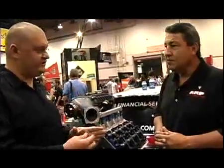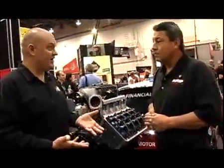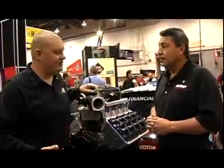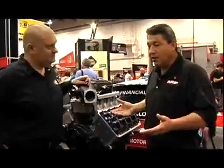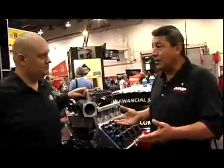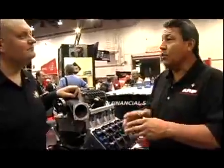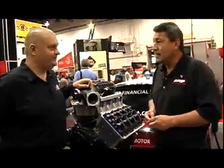The stretch gauge is great because if a certain fastener is stretched a certain amount, it's going to yield a certain clamp force. As stated in the catalog, a fastener is essentially a spring. Like a throttle spring in your car — as long as it's installed properly as designed by the manufacturer, it'll go a million miles and the car will rot away but that spring could still be working just fine. Whereas if you put that spring in an under-load or overload condition, you're going to either yield it or it's just not going to hold anything.